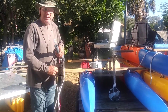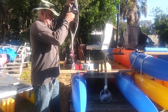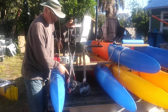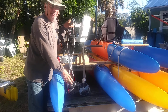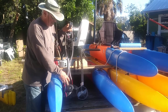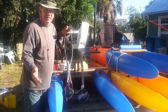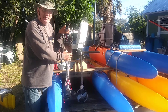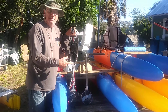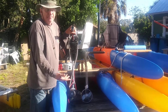By the way, the Vaquita does about the same speed or better than the Newport. If you look at the size of the hub and the weight of it, this kind of motor is designed to push a heavy boat slowly — like a Jon boat or a bass boat. The Vaquita is designed to push a light boat fairly quickly. Using a high-torque trolling motor on a lightweight boat wastes energy just spinning that torquey prop, which you don't really need.